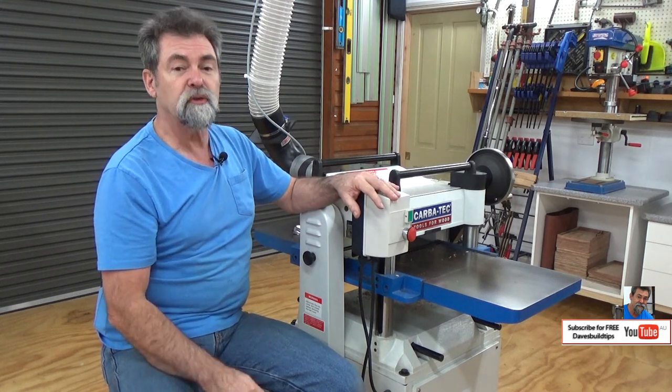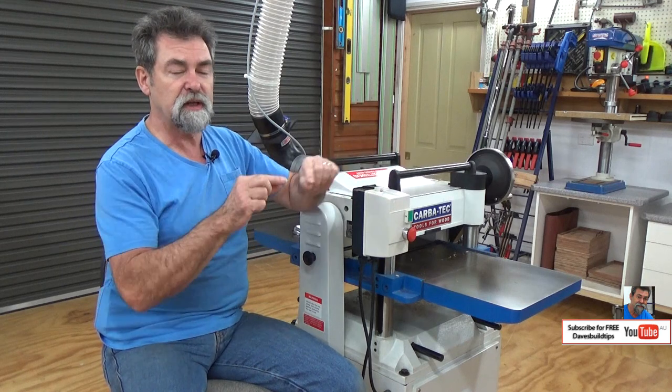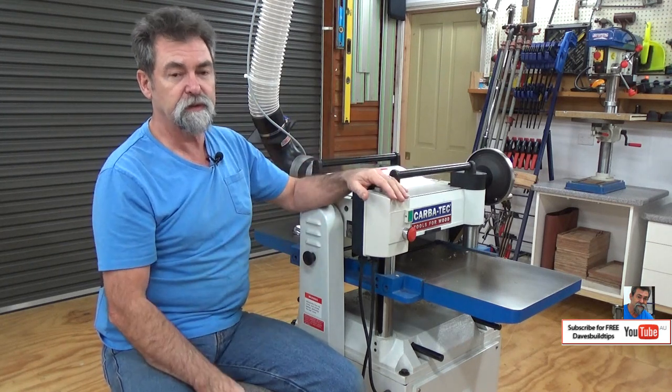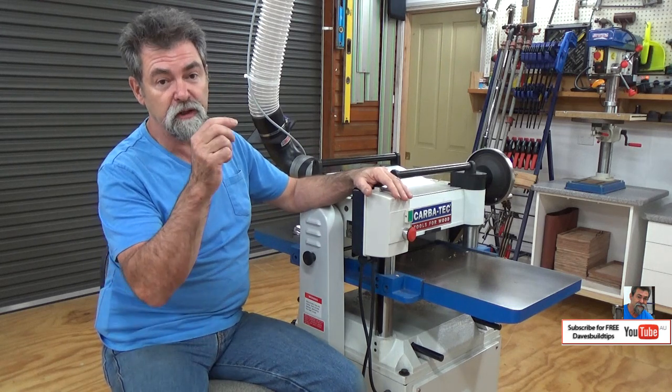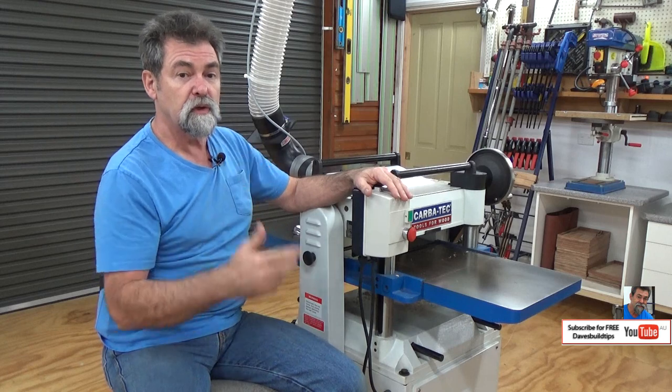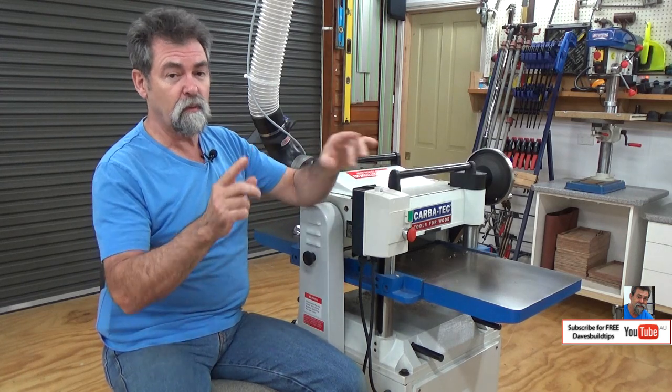There's another advantage: no setting required. You don't need to use a setting jig to set the blades — it's a machined head, they go in perfect. And you have the fact that you can rotate each knife when it wears out, so you have four bites at the cherry instead of one.